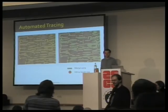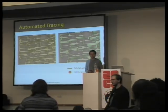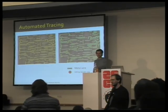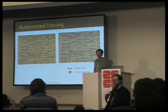Just a quick question. When you've done all this reverse engineering, you will have the working description of the chip in machine-readable form. Have you considered trying to simulate the chip based on this information to judge whether or not it behaves like your real chip does? Yes. In fact, my answer just a minute ago, that we could automatically reverse engineer the different logic cells, would require simulation of each logic cell. So we can simulate parts of it or even the entire chip, but it gets extremely slow. Simulating hardware in software is not efficient, and we have so far only reverse engineered cryptography, where it was very clear when we found the right function and we didn't actually have to simulate it.